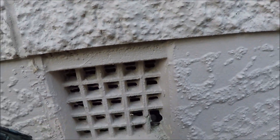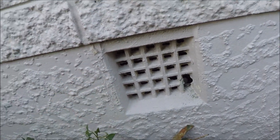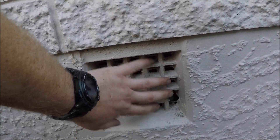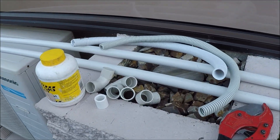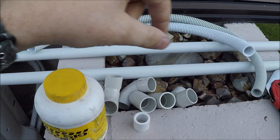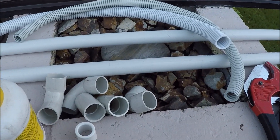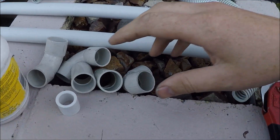Just be careful not to break too many of these out, because as soon as you start doing that this whole thing can fall away. Under the house I'm going to run some conduit — this is what the fibre line is going to run in. While I'm under there I'm going to pull that draw cable through it, so tomorrow when the guys come to hook it up they can just pull their fibre line through off the draw cable.